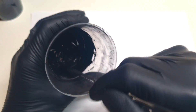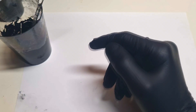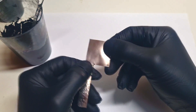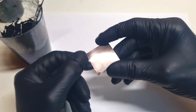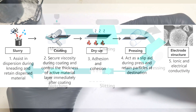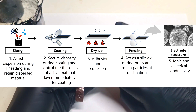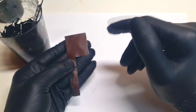When you have your mix like I have over here, you need to coat this slurry on some current collector. When you coat the current collector with your slurry, you then need to leave it so that all the water evaporates, and you will end up with a dry form of active material. In the end it is also really helpful if you can press that electrode tightly together, because then you will get a really nice contact between the active material and the current collector.